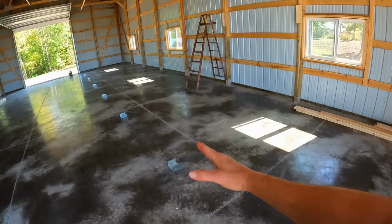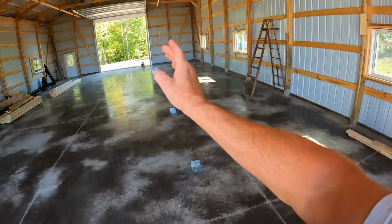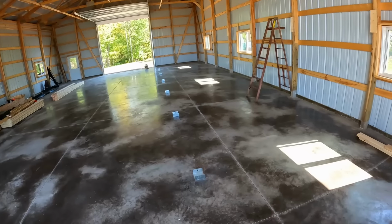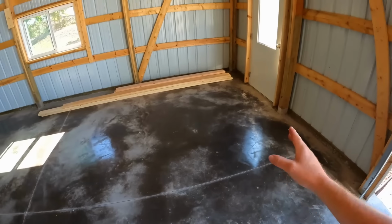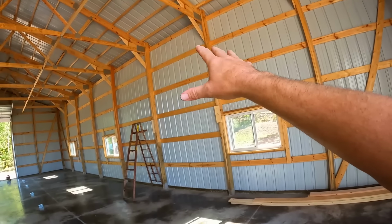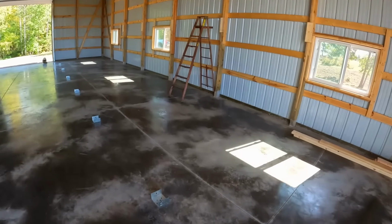So that puts us 12 feet out from that wall. So that's where all of our main support posts are going to go. And that also holds us in about 1 foot from the edge of the door opening. We're running at 48 feet from that end wall to right here. This last 16 feet to that side entry door is going to remain open to facilitate better access to that end of the loft, give us some more room for some higher clearance storage.